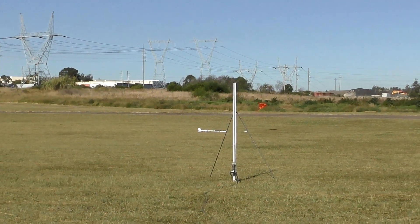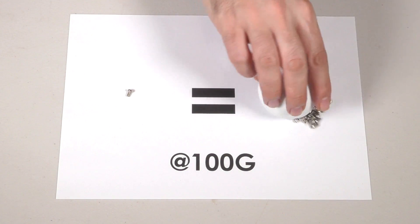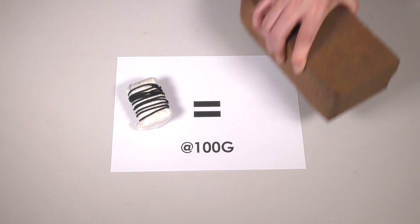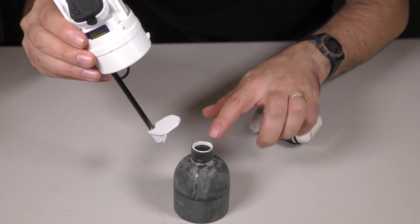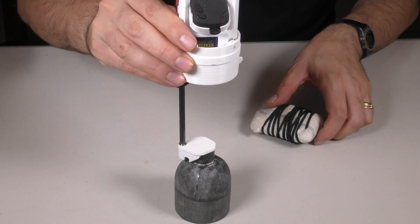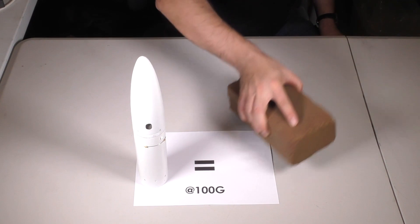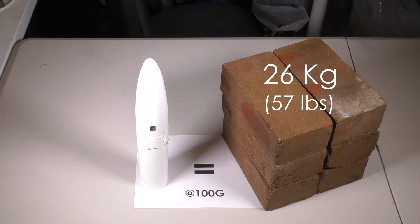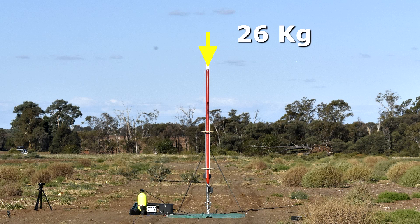The whole mechanism is designed to withstand at least 100G of acceleration. Each screw you add to the design is the equivalent weight of a hundred screws under those loads. The 45 gram parachute and short cord alone weigh as much as a four-and-a-half kilo house brick. Because the parachute weighs so much at launch, the actual ejector plate has to sit on top of the pressure chamber so it doesn't snap off. The entire mechanism with everything in it weighs the equivalent of six house bricks — around 26 kilos or 57 pounds — pushing on top of the pressure chamber during launch.